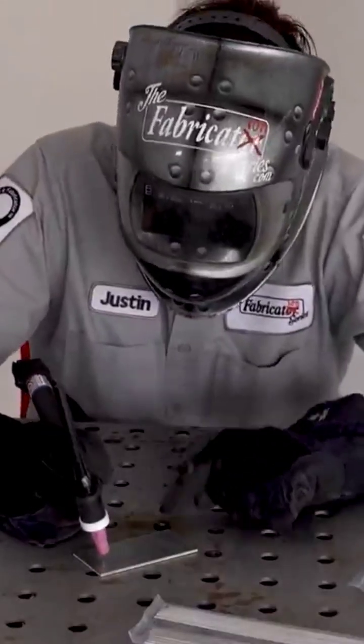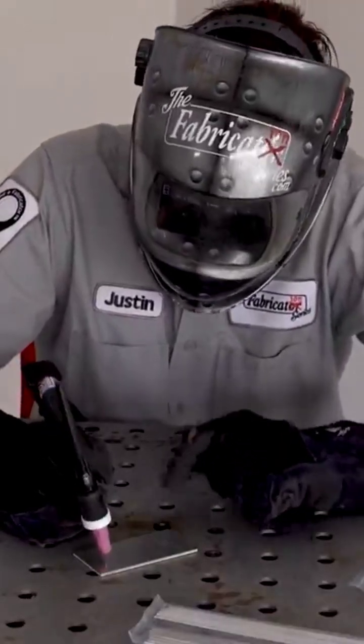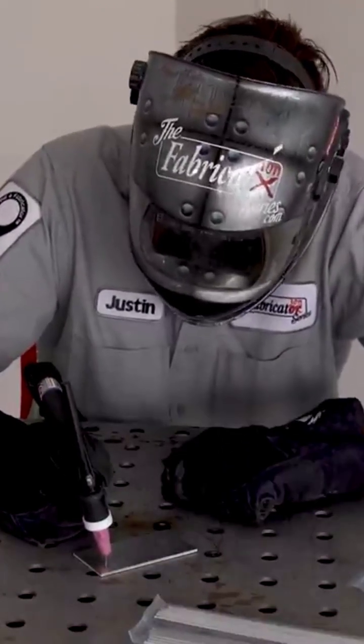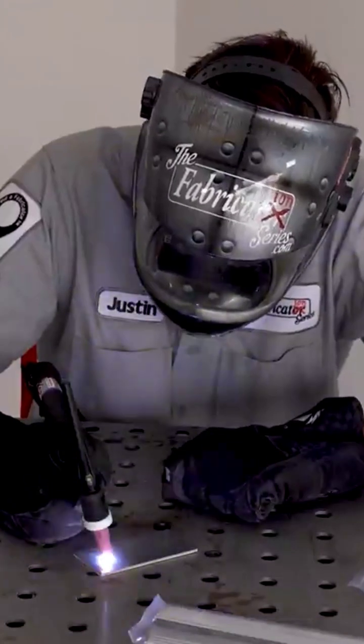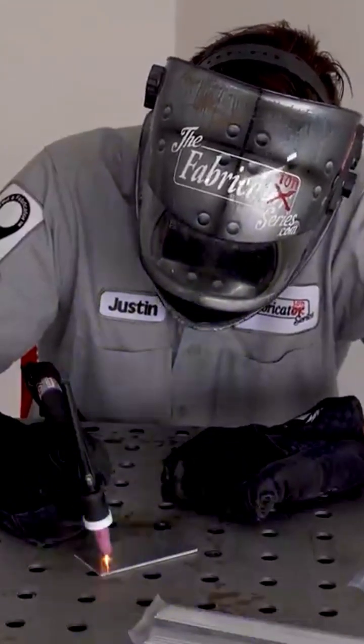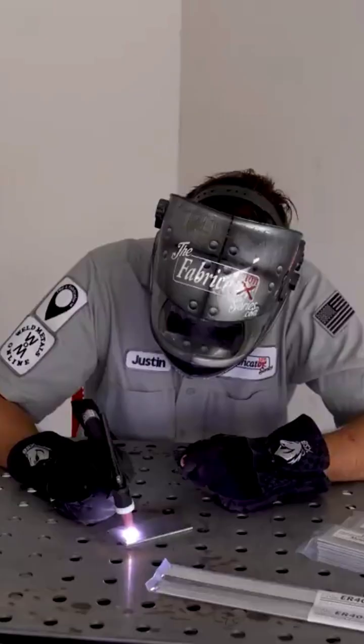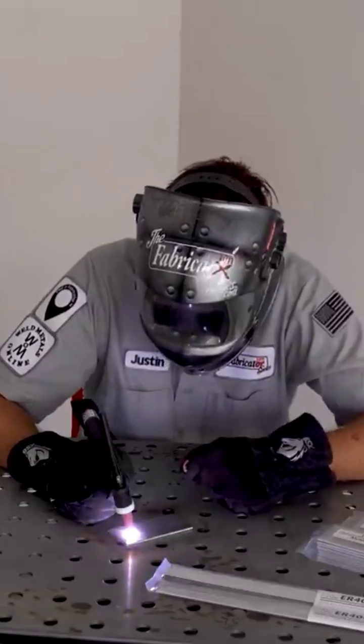Let's drop this hood and see what happens when we start initiating this arc. I'm going to fire off — I'm relatively close — so let's drop this and see what's going on. I initiate and you hear all that sparky, nasty, unfocused arc. That's not enough amps to keep this lit.